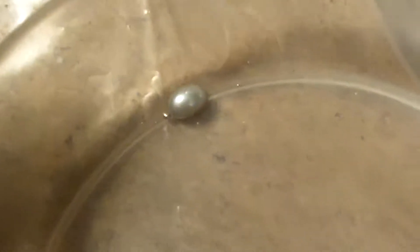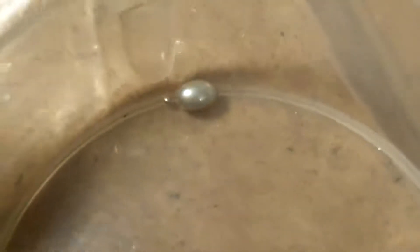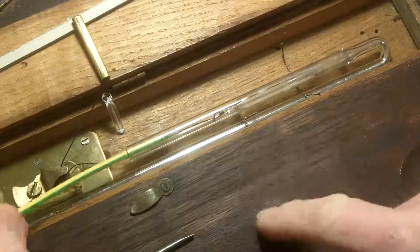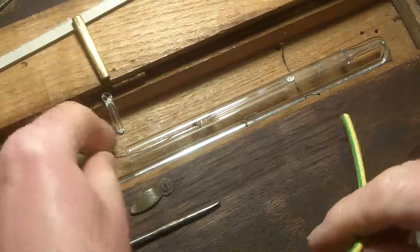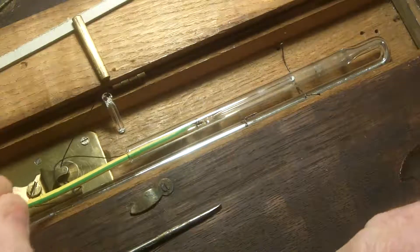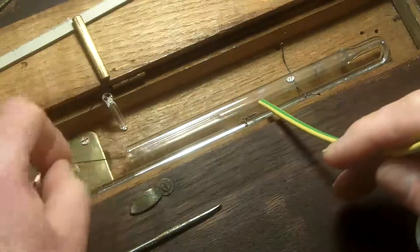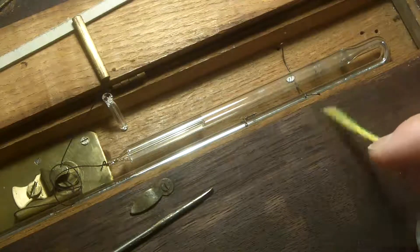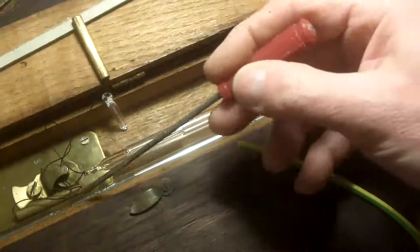This is the mercury that I've retrieved out of the case. One of my old bosses told me that they used to clean mercury by squeezing it through chamois leather, and that seems quite reasonable. I've got myself into a situation now where this bottom weight moves up and down freely. If there was some grit or dirt in there I didn't actually find it — I always like to find the cause when clearing a fault, but anyway that's clear. There's some oxidisation on the tube there but I'm not going to worry about that at this stage.